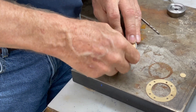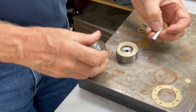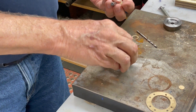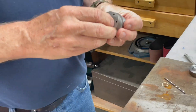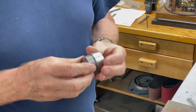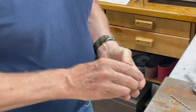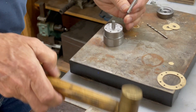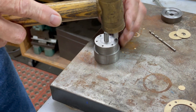This is pretty precise so you have to sort of pull it apart. There's the gasket. Now I put that in the bottom punch, put this back on with the dowel pin, and I line up my punch marks. Of course it's pretty hard to line them up exactly, so you have to search for the first hole — I'll show you this hole.